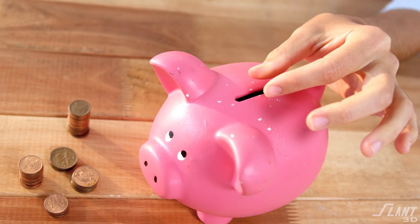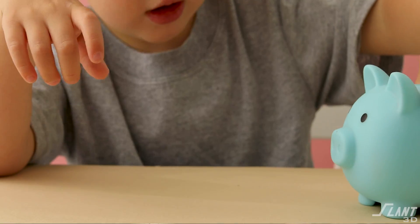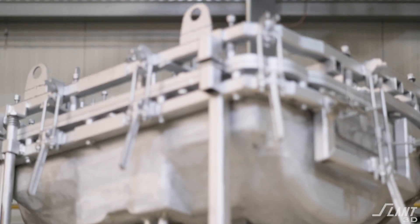But now, when I was looking for new products to demonstrate how 3D printing could really help, piggy banks were actually a phenomenal example. Traditionally, they're too big, chunky and complex to use things like injection molding because they have too much material and are often so thick that they'd cause shrinkage. So you end up using rotational molding, which is fine because nobody has to see the inside.